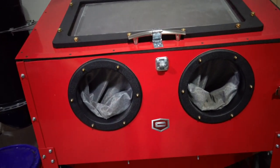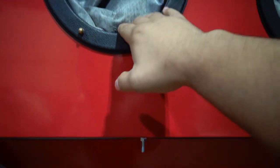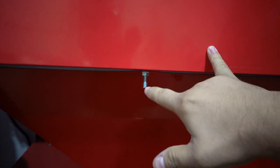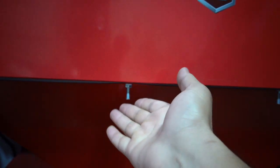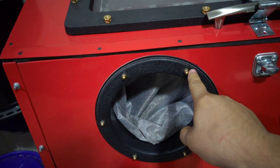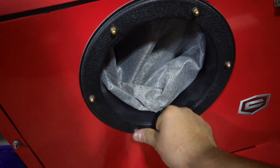When it comes to the sandblasting cabinet, I did everything backwards in regards to the bolts and nuts — from the inside out instead of from the outside in — basically so that my gloves or anything in there wouldn't get caught up on the bolts. I also put acorn nuts on the ends so that it wouldn't be pointy and I don't get hurt.